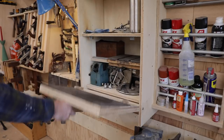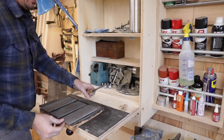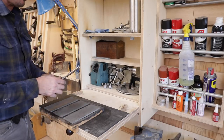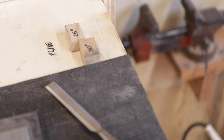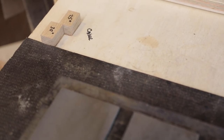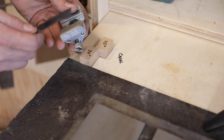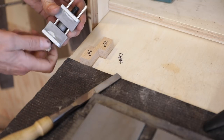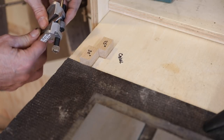This sharpening station I built maybe a year ago — I've really enjoyed it. I always sharpen my chisels or plane irons before I use them, not when I put them away. Having everything neat and here is really helpful. What saved a lot of time was gluing these little blocks at 25 and 30 degrees — that side is for the planes and over here is for the chisels. I've had real good luck using these chisel guide rollers — it's a guide that helps me keep everything lined up, with a wide clamp on top for the irons and chisels on the inside.